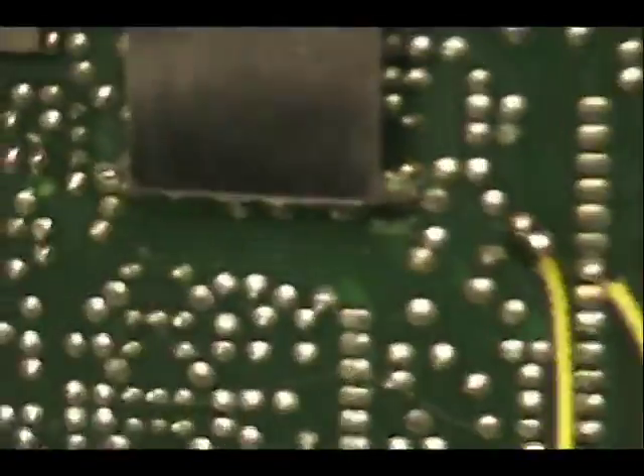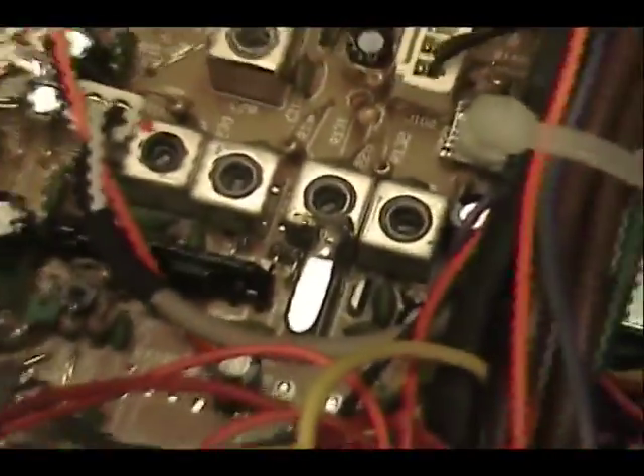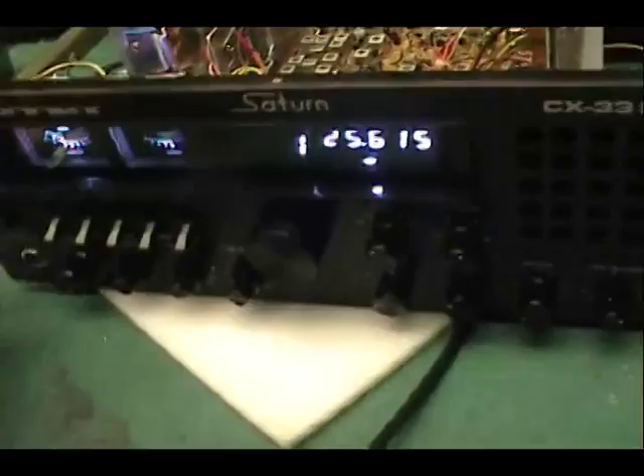On the bottom, I'm going to have to take this shield off. And on the top, remove that little bit of solder. And of course the two solder points underneath when the shield comes off. So let me pop that out of there and we're going to put in the other crystal.